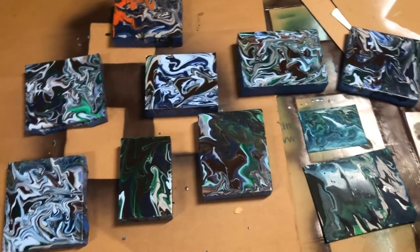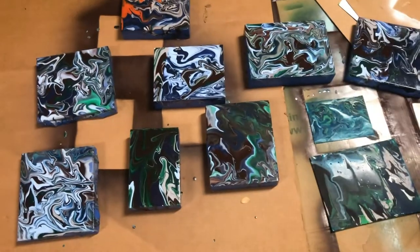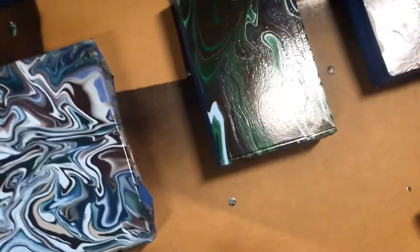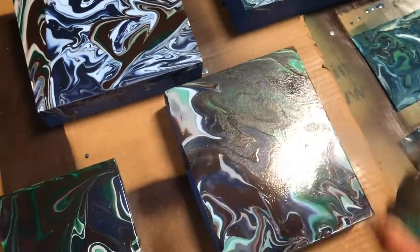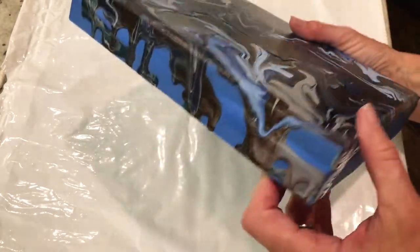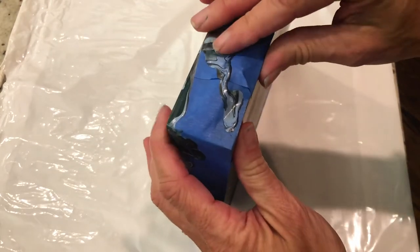To finish mine, I used a polycrylic in a crystal clear — this is a matte finish. I think if I were going to do this again, I probably would have done a high gloss finish, but when I was planning this project I was planning on putting something on top of the box that was a little more rustic, so I didn't want that high gloss lacquer shine. Once it was completely dry — I let it dry overnight outside in my garage — and then once I felt like I could touch it without it being too tacky, I moved it inside because it's been so humid here to hopefully speed up the drying process. Then comes the fun part: taking off the painter's tape.